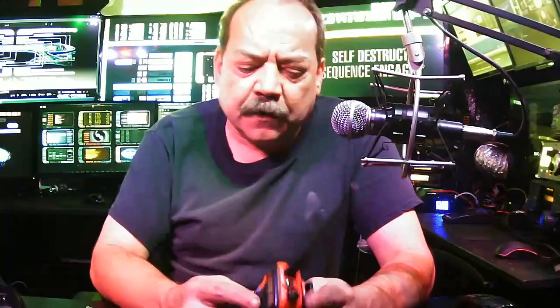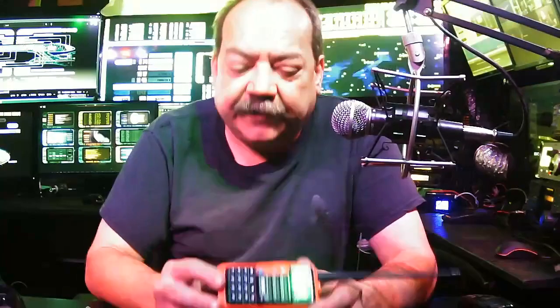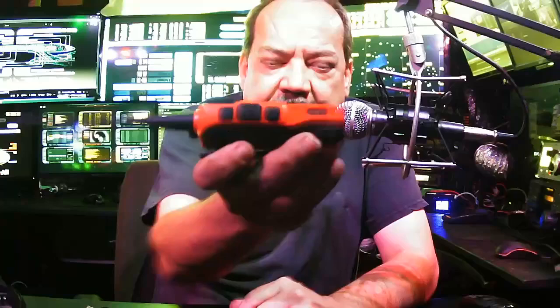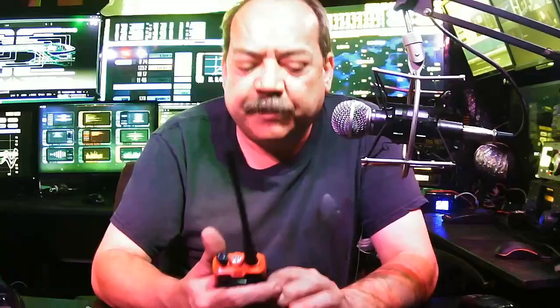This radio has 128 programmable channels and you'd use CHIRP to program it. They also make this exact radio — it looks just like this — called the UV9S tri-band, and it actually has the 220 band built into it. This one happens to be one of those upgraded ones, and you can always tell from the little sticker on the side. It says 'UV9S tri.' It's the same as the UV5R, except you can also program it to work on the 220 band, the 1.25-meter band.